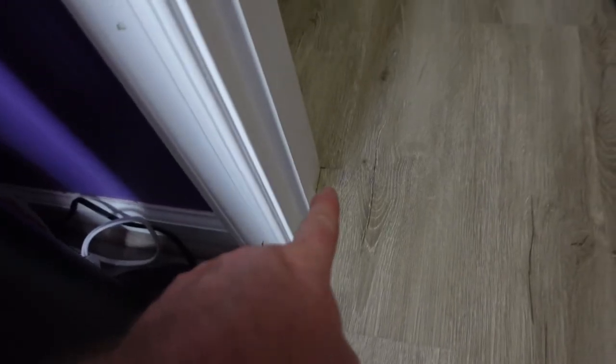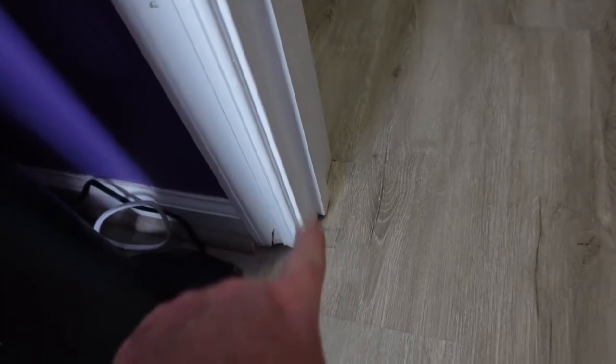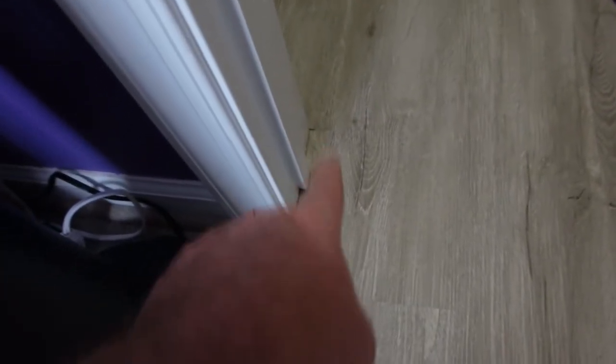And I do wanna show this other piece here that's like the little puzzle piece, if you will. Because of the way you have to lay this, snap this together and lay it down, I had to leave a little bit of a gap here and then cut in and piece in a little puzzle piece. It's not perfect, but when you're just walking in the room and doing what you gotta do, it's highly unnoticeable. So those little pieces are not 100% perfect, but that's why you got a Mohawk fill stick.